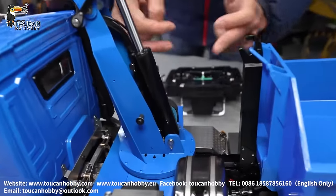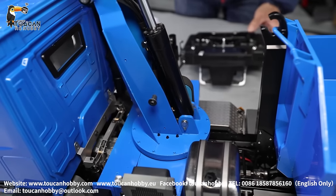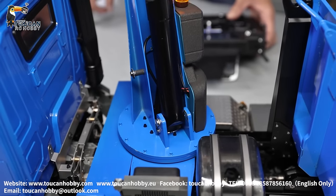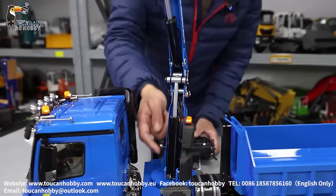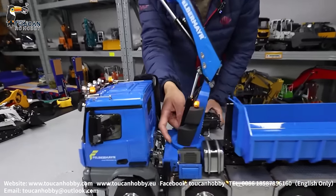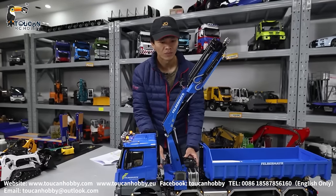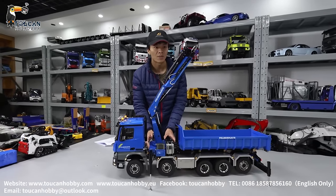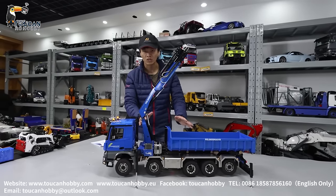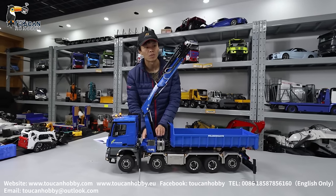Another astonishing function is that this turning plate has an electric slip ring and a hydraulic slip ring, so it can turn all the way, 360 degrees, without having to stop, with 2 slip rings inside. You see the arm and the chassis, the thickness of the steel plate. You can imagine how strong this is; it's almost 2 millimeters. At this angle, we will reach out the small arm, giving a little more power from the pump. The pump is now on mixed control, but for more power you can switch on the pump at idle speed, low speed.